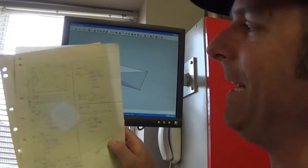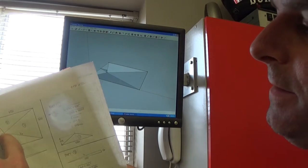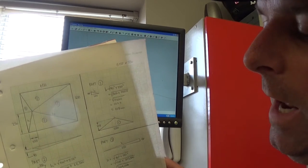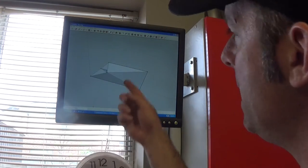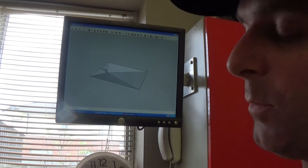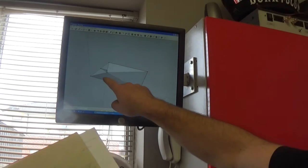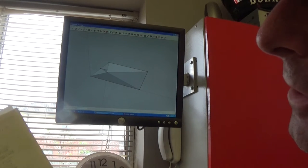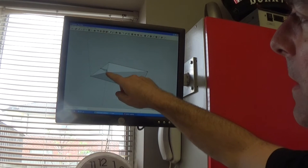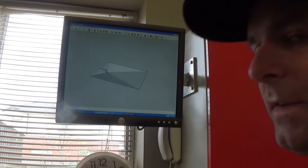So I've just spent half an hour like an idiot working out the shape of all these triangles based on the fact that the center point's lower than the edge, and then I realized: use SketchUp — and it took me about two minutes to do it that way. Good thing is my maths is alright, so I now know the shape of these pieces and I know exactly how to cut them out of a sheet of aluminium. When I weld them together I should get a tray with a 40 millimeter depression in the center. So let's go chop some aluminium.